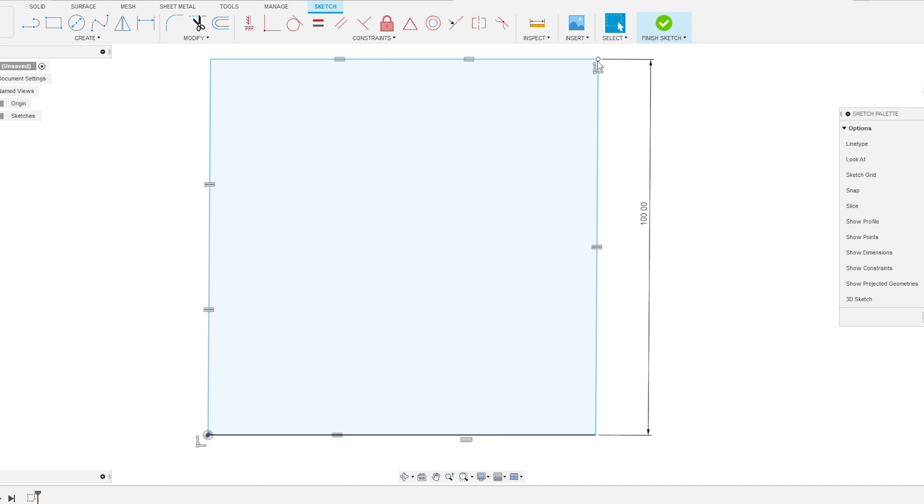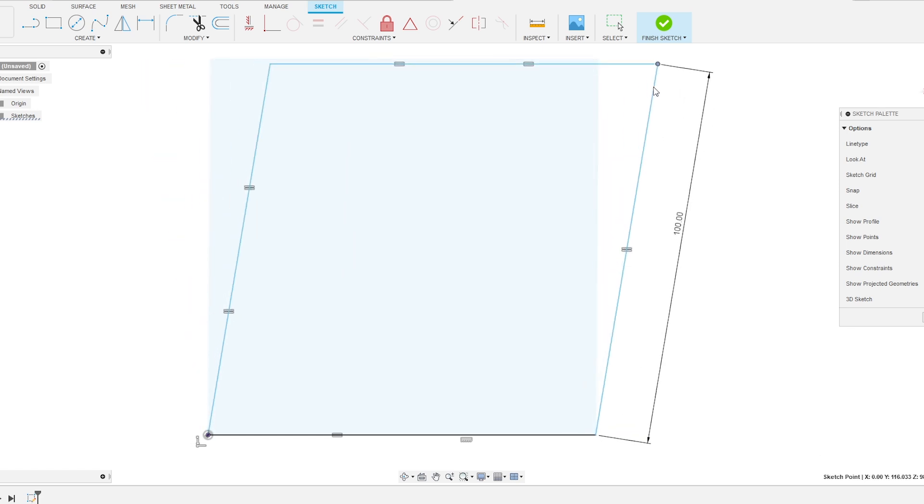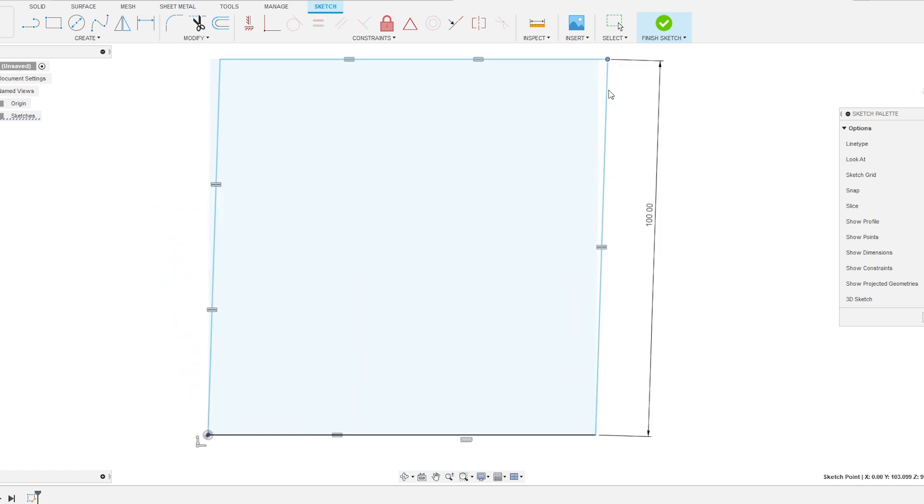In the world of woodworking, this is what's called racking. And racking is simply the fact that you can have a perfectly equal square or rectangle, and they can change angles and become just a parallelogram. And you can see here, if I drag the top right corner, even though all lengths are fixed, I'm able to wiggle it back and forth.